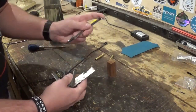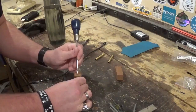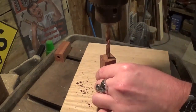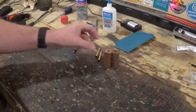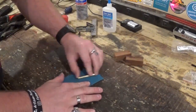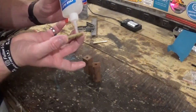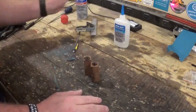I don't have any of the fancy pin turning equipment — just doing it my way. We will head over to the drill press and use a pair of pliers to hold everything in place while drilling for the brass tubes. This drill bit is the same size as the brass tubes. Then we will head back to the workbench and use rough sandpaper to scuff up the brass tubes. You have to do this in order for the CA glue to grab and bite when it's glued into the wood blank. I will glue these in, use a bit of activator, and set them aside to dry for three or four minutes.